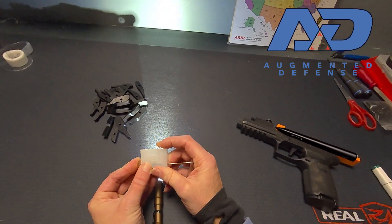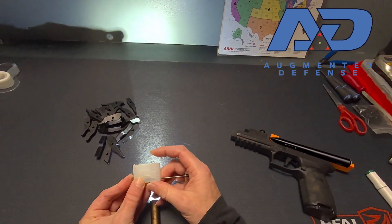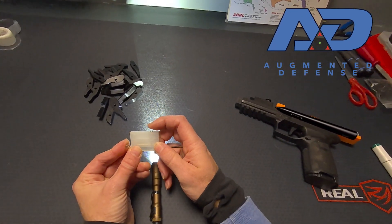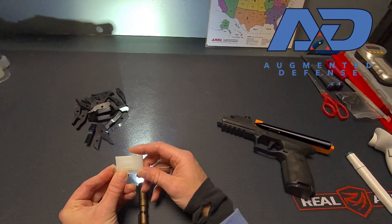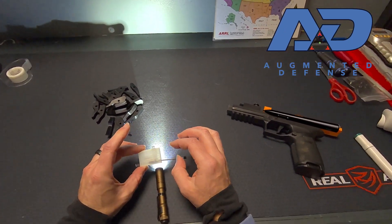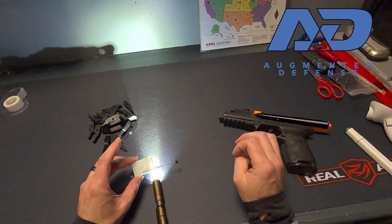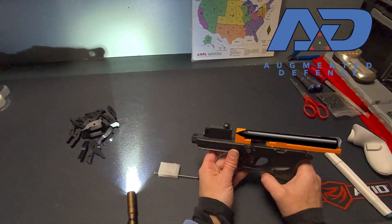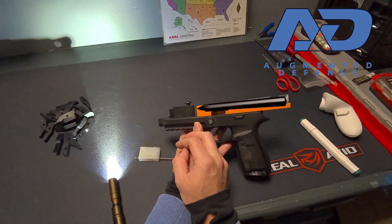Both of these are adjustable. I am running a smaller spring in that one, so this setup lets me push both with a hand. I can go really, really light — like a race gun trigger — or I can go heavy like a duty pistol. When I'm working on other designs and want to put this in the rifle I'm doing or other hardware later, instead of worrying about fitting all those internals into every new design, I have a module I can just drop in. It also means during testing, I don't have to rebuild this area every single time.